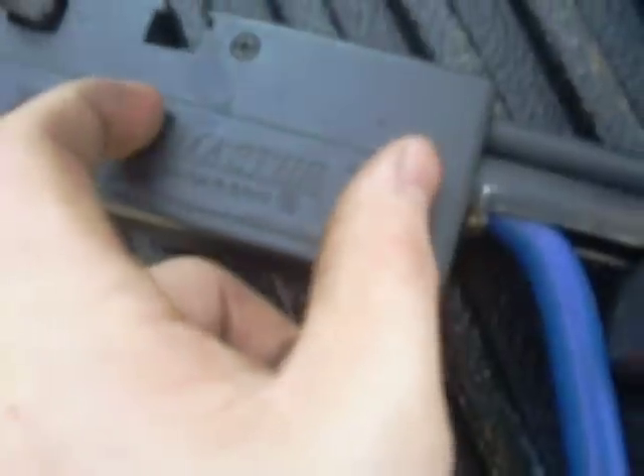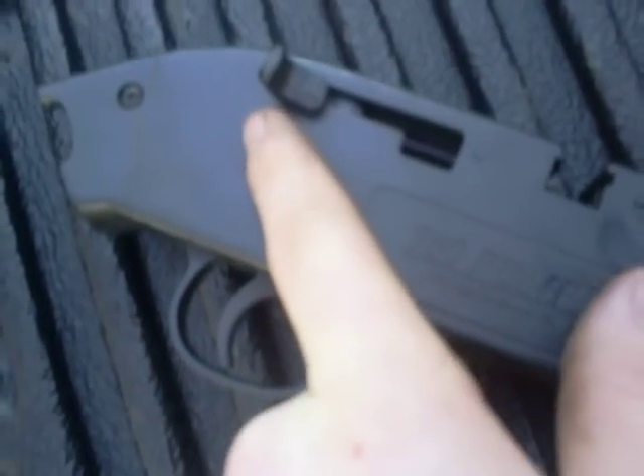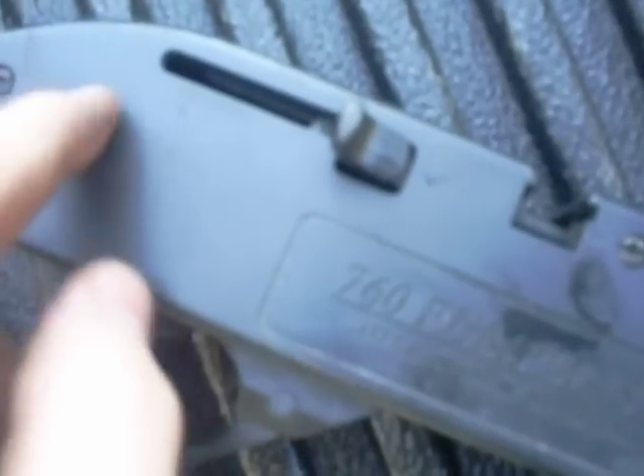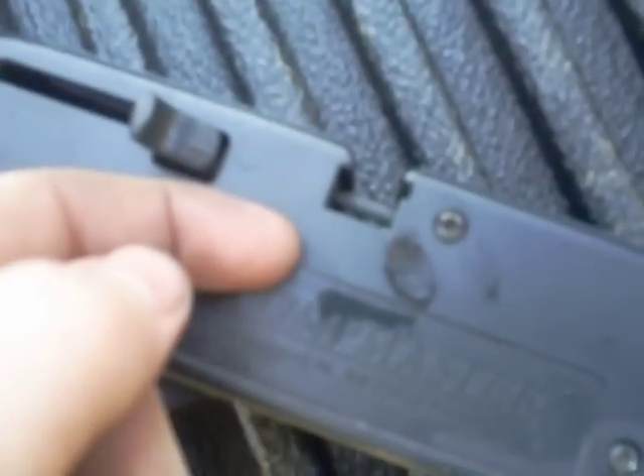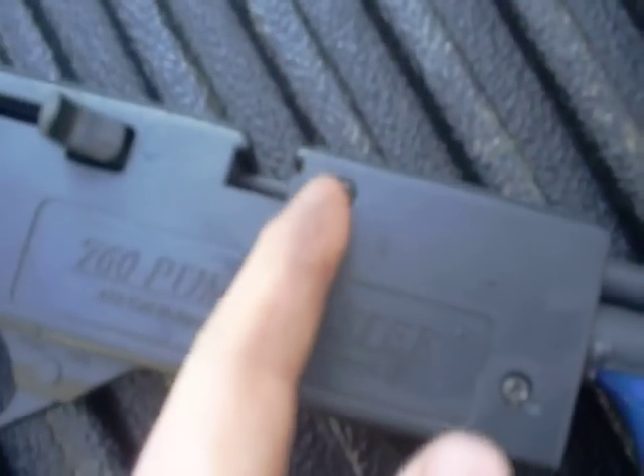There's a little brass piece in there that holds the air. It screws in two pieces — I took the front part off. On the back piece, when you cock it back, there's like a little hammer — you could call it the firing pin — it comes back, and then you pull the trigger and it comes forward, hits the back of that brass part, which pushes a little pin in that releases the air and sends it up into the barrel.